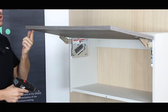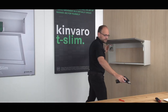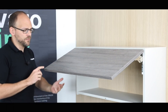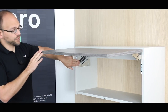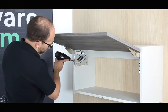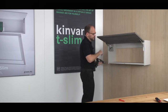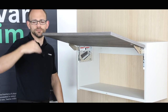There's a slot scale on the side where you can easily read off how much spring force you've set. It drops slightly, and we then have to readjust it a little. Now it stays in place — you can adjust it exactly as required. Now it can be opened up to here. If you want to increase the opening angle, then you just go up with the spring force — this means more tension. We can do this straight away on both sides, and you immediately notice the difference. When I close and open it again, you can see that the opening angle has increased significantly.